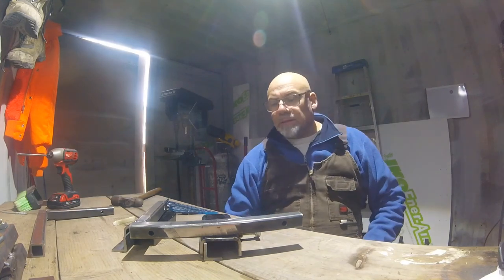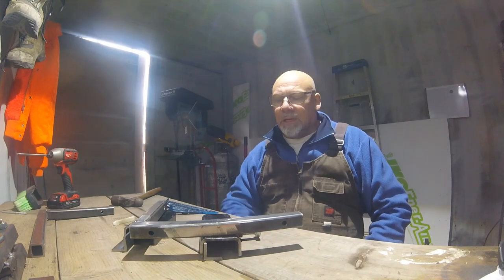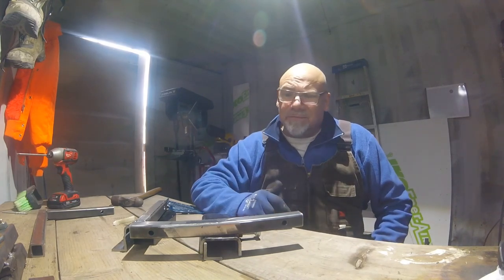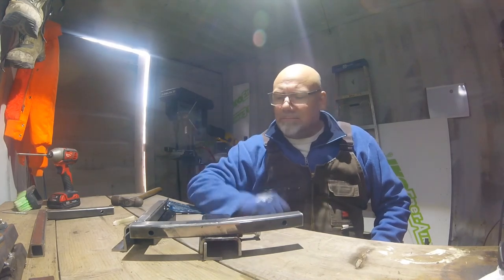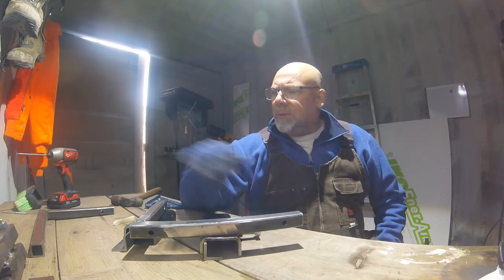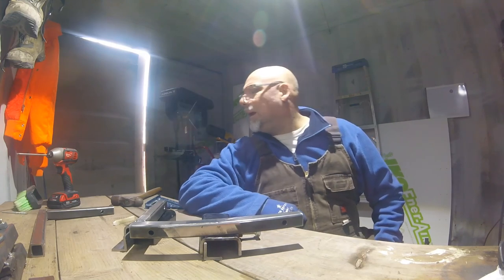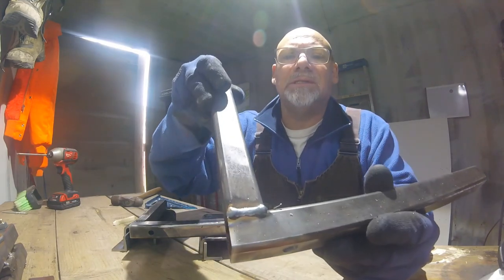All right, time to weld. Tack this all up and get the other one tacked all up. Actually, I'm just gonna do good big tacks. It's enough for that. Let's say 1-inch tack here and there. It's more than plenty. Having a lot of trouble with that welder. Get a little bit of porosity. The weld is not consistent, so it's okay, but it's just not consistent.